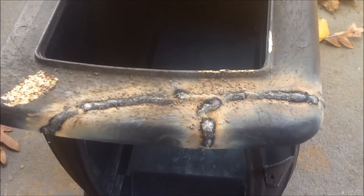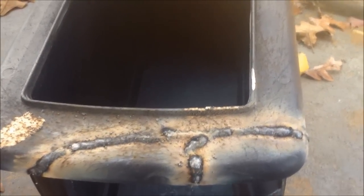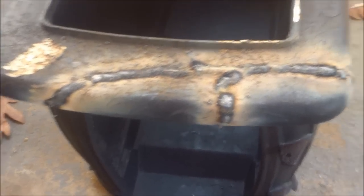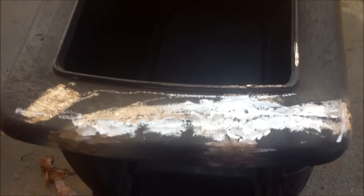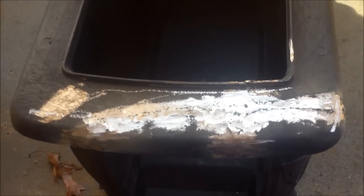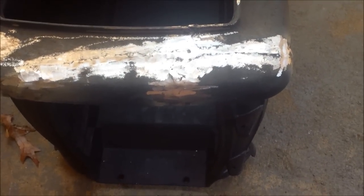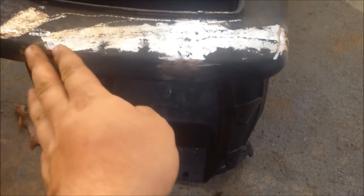She's all welded back together. Now time to get the grinder out and smooth her down. I found the welder works best on three — this is the Harbor Freight 90 amp flux wire welder. Now I'm going to grind it smooth and then it'll be ready for paint — grind off all the slag. So yeah, a little detour putting together the stove. It's repaired — about 40 minutes later, only about 15 minutes of welding and about 30 minutes of grinding. We're ready for high heat paint. Luckily the piece covers this so you can't really tell — you'll just think it's a scratch or something.